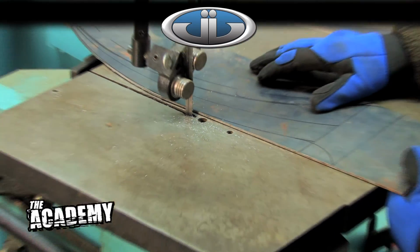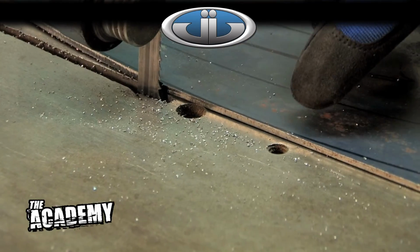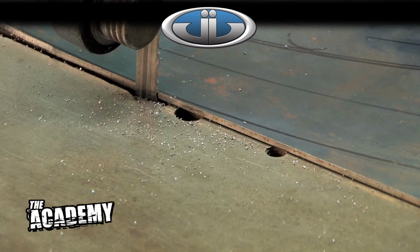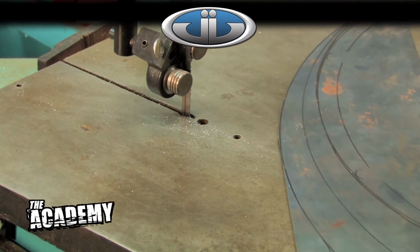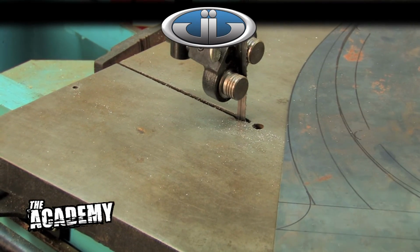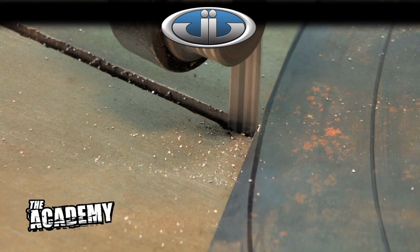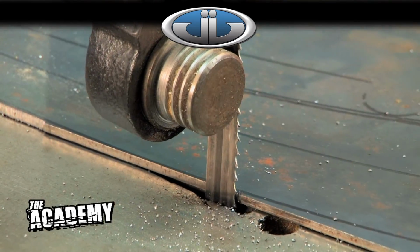Okay. A good little trick that you can do when you're trying to follow a line like this, I've got a real narrow piece there where I got to start the blade. It's difficult to start the blade on an edge like this. So what you can do is turn the piece perpendicular to the blade and make yourself just a little notch. And that'll help you get the blade started on that sharp point there.